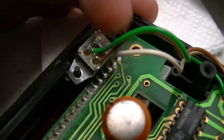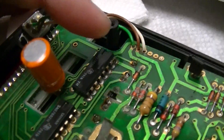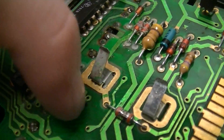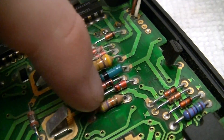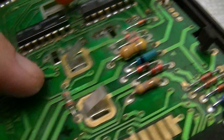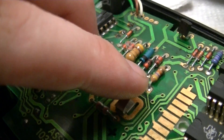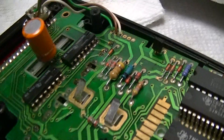One little interesting tidbit is that this employs switching on the DC neutral instead of the DC hot. I just follow the traces and they go right back to this, which is the DC neutral connection. And there's some diodes here which are for the bridge rectifier, because the charging port supply is AC.